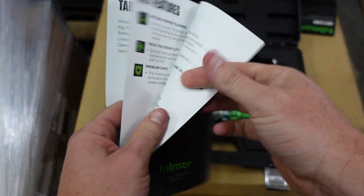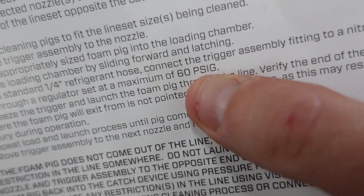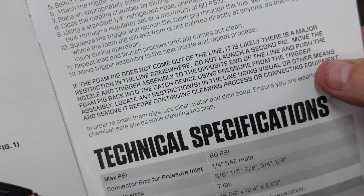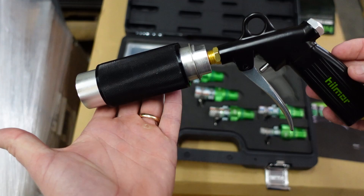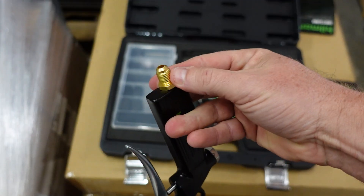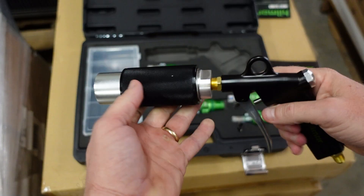One of the things that they've tested is the pressure — they suggest using 60 psi, and if it doesn't go through, just force it back the other way, because then the restriction is too great. That's nice — they've clarified some of that. The first thing you're going to notice is the launcher that they use to push the plugs through to clean the line set. It's actually really nice, has a nice hand feel to it, with just your standard quarter-inch connector on the base.